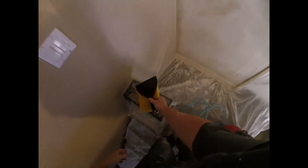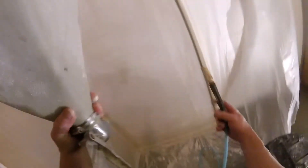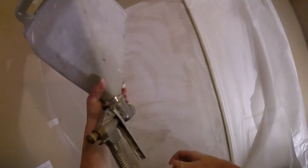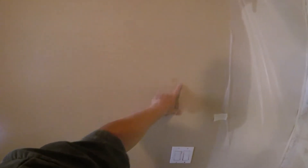The first thing I like to do is get everything ready — get my hoses ready, get everything hooked up. The air compressor is full to the maximum, so it should be off now. Once you hook up your hopper, you want to turn on the adjustment to let some air flow. You don't want to start spraying right away — drain some of the air because it's at maximum pressure and will spray harder at the beginning. Then try spraying on your plastic masking to get the pattern, depth, and texture you're looking for.